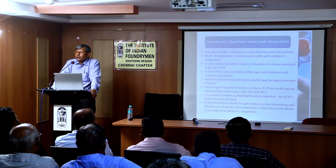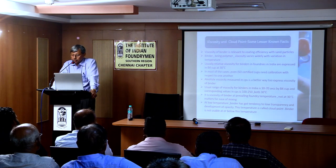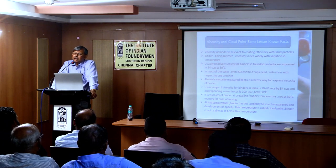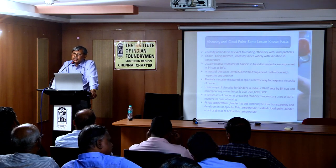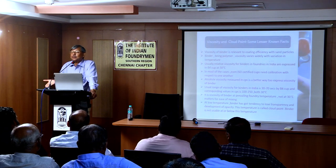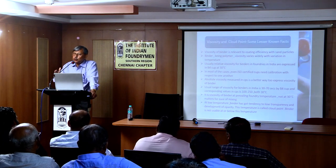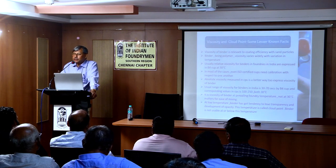Then again, okay, at 30 degrees centigrade, viscosity will be in the range of, say, 30 to 70. In fact, my experience is that the most commonly usable viscosity range is 30 to 70 seconds. At what temperature? The temperature at which you are using the material. Suppose you are using the material from 20 to 45, the viscosity should cover this range because of ease of miscibility.